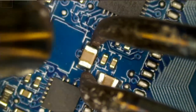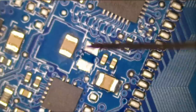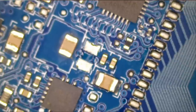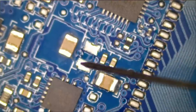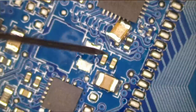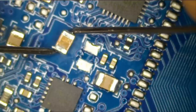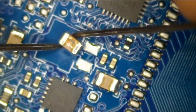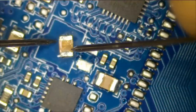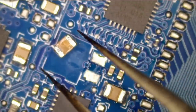We're going to start with this one — the cap that is the closest to the chip — and see, do we still have a short? Meter in diode mode. We no longer have a short. I did not measure the cap before I removed it, but we can put the meter in continuity mode and test the cap. If it's continuous, then the cap is definitely bad. And look at that — the cap is acting as a line. We can tell the cap is bad. Look at this — it was not visible from the top, but the bottom of the cap is gone. I knew the cap closest to the chip is what's bad.